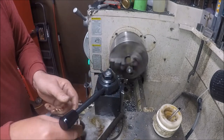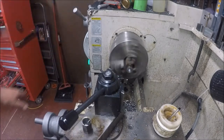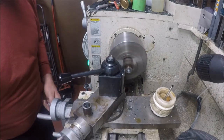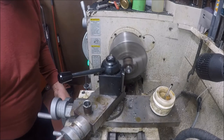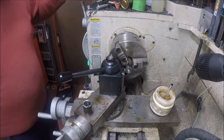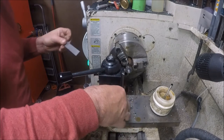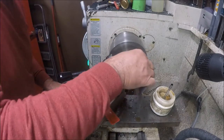Turn this one over and we'll deburr it here in a minute, and go from there. Boy, oh boy. All right, now this one here, you notice, happened to be turned the right diameter. Oh crap, I didn't even set the stop. I sat there and laid this out, and I don't know what end, but Jesus, I did. I didn't set the stop. I pulled it up the quarter of an inch, so to speak, and didn't even set the stupid stop.